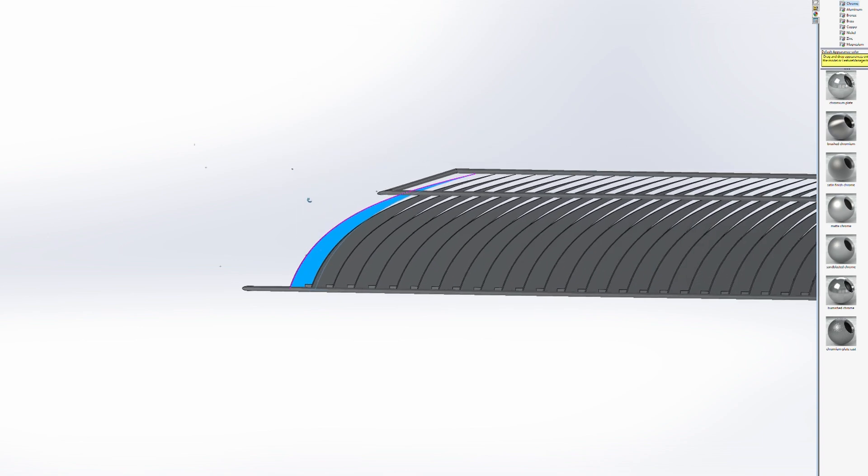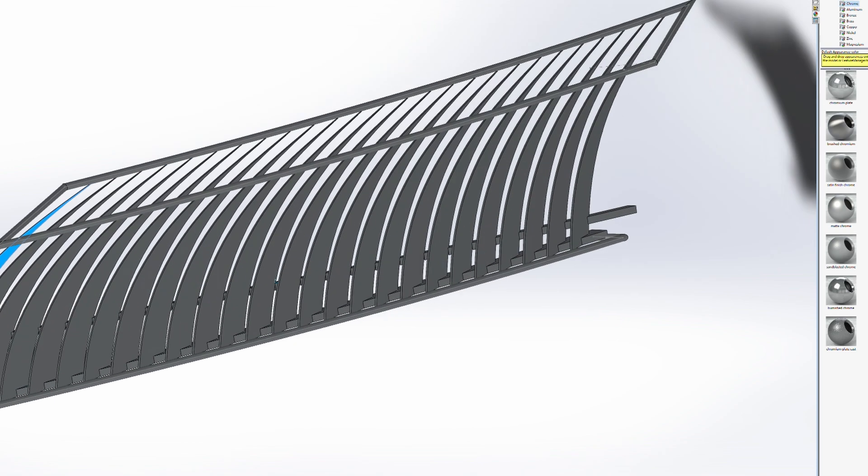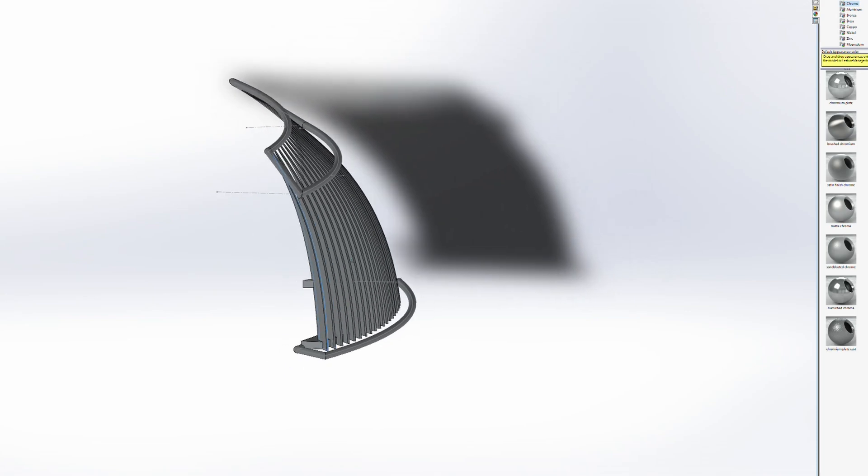Note the negative spaces between the louvers. These pieces are called drops and they're usually thrown away. Since I was broke, instead of throwing them away I made this. You can see how the drops arrayed form a virtual complex surface — not bad, eh? The partial fender was placed behind the nose in order to further develop that shape. Obviously this method of fabrication could be expanded much further and made much more complex by varying the original cutout shape of the louvers, and it follows that the shape of the drops will also vary.